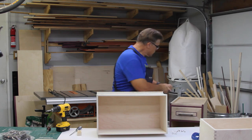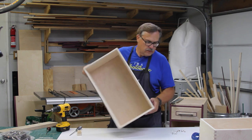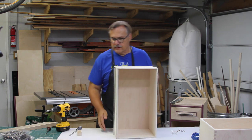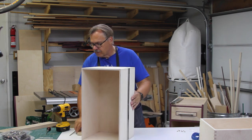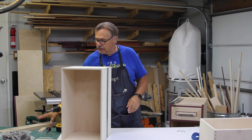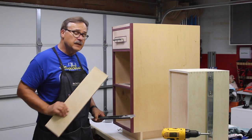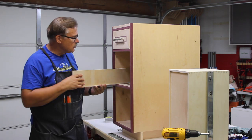This slide is going to go on this side of the cabinet. Let me bring the cabinet up here, move the camera around, and show you what I'm going to do inside the cabinet with the same jig. With my cabinet in place, I'm going to install the cabinet side of the drawer slide.